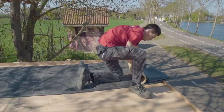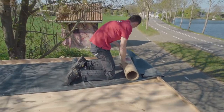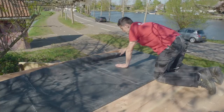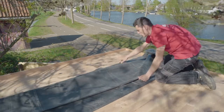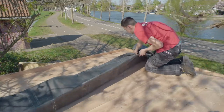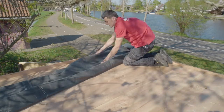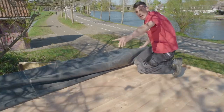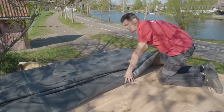There's ample film to cover the entire length as you can see, and the same will apply for the width. So do make use of that overlap as it makes the rest of the process that much easier. First fold back the top to reveal the bottom flap, which is the edge of the EPDM film. Take the edge towards the fascia board and make use of the overlap the same as you did lengthways. Now we can open the film up the other direction, and this has to be done in sections since that's how the film has been rolled up as well.